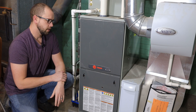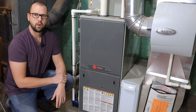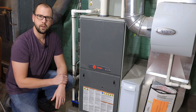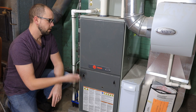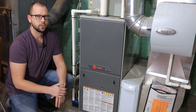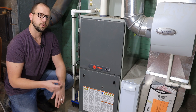Before you get started, you don't really want to slow down the speed of your blower unless you've consulted with an HVAC installer or specialist, because if you don't have enough flow going across your heat exchanger, you could really overheat the heat exchanger, which is going to shorten the life of it or could ultimately lead to a crack.